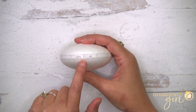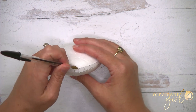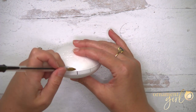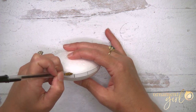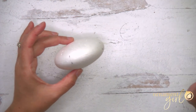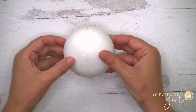In addition, make a mark right at the start and end point of the strip itself — just make a little line above and below your strip to mark that spot, then turn the disc and do the same at all of the dark lines on the strip. When you're done you'll have four sets of dashes drawn, then remove your strip. We're going to connect opposing lines to divide the disc into quarters.